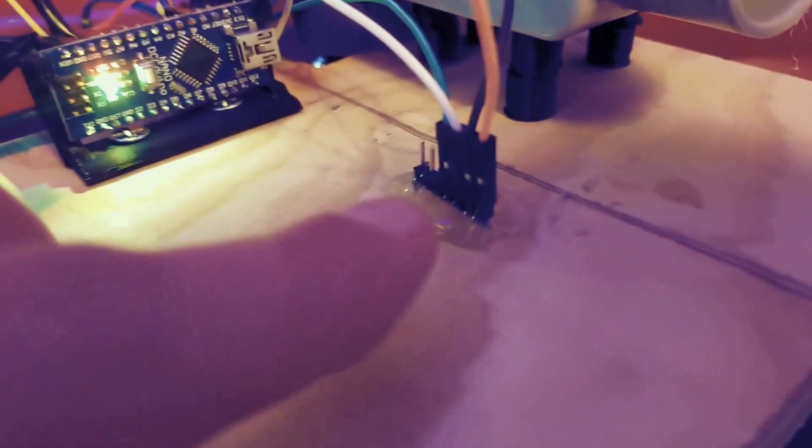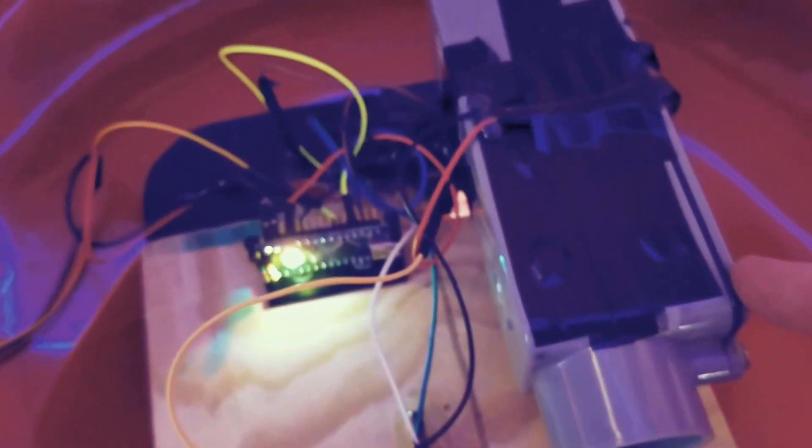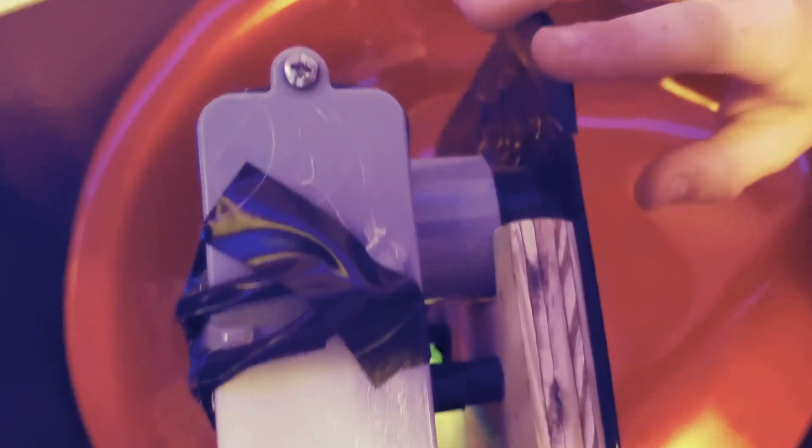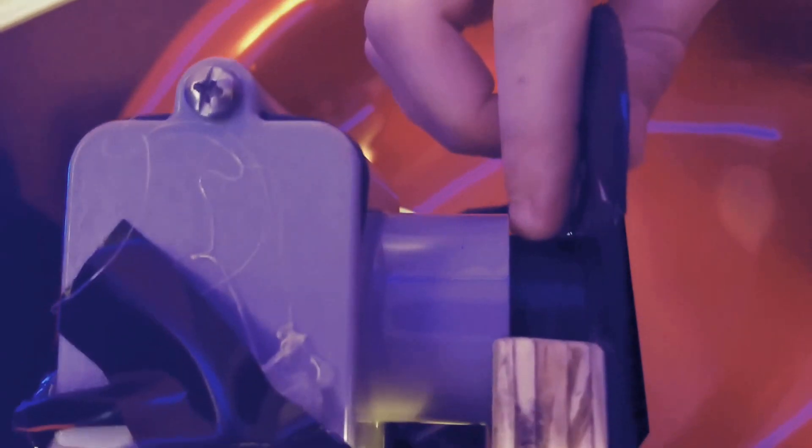All right, here's what the inside looks like. We have the Arduino Micro here with various wires, and this is a grounding block that Landon soldered — you can see all the ground wires connected. Over here is a piece of PVC from Lowe's — we drilled two holes here and four holes on the back, then covered it with tape so no light interferes with the emitter and receiver. There's a tube on the side and a 3D printed piece where the coin slides down, then falls past the IR emitter and receiver and down to the bottom.